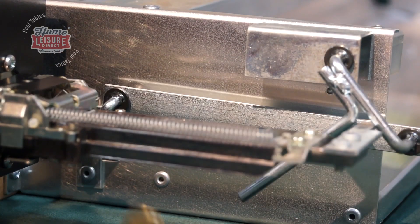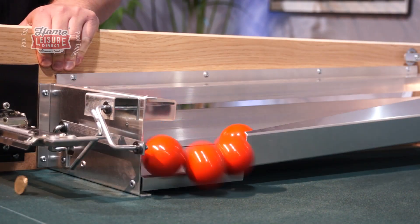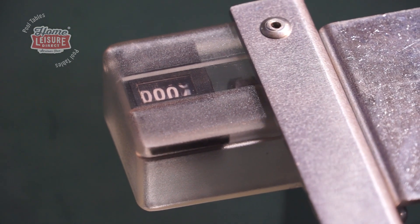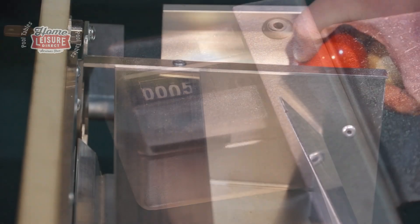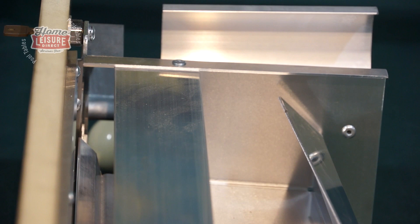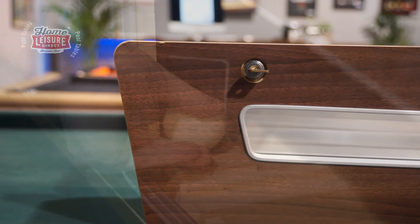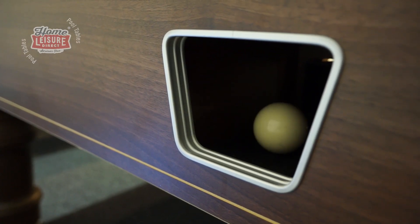Pushing the coin in will leave the ball release mechanism open, allowing all the balls in the tray to be released and then delivered to the ball delivery hole at the end of the table. There's even a counter installed on the top of the mechanism that allows you to see just how many games have been played. The cue ball is slightly different to the object balls and won't be delivered to this tray. Being a little smaller, the cue ball will feed out of the tray instead of going into it, travel down the passage on the left, and be delivered to its own ball return.